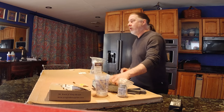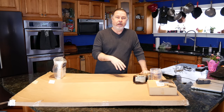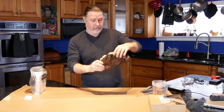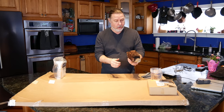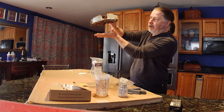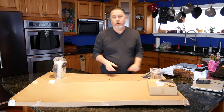The windlass has a shaft about this long, and it's about 3½ inches too long for the Hatteras. The space between the lower part of the deck and the top part of the pulpit is about 3½ inches too long for the shaft. When they put the windlass on — whether it was Hatteras or aftermarket, I don't know — they used this as a spacer. It's basically layered wood, painted, and the carriage bolts come through the pulpit, through the deck, and onto the mounting plate for the gearbox. I need to replace this, as it was rotted and came apart in pieces.